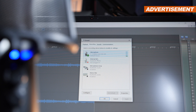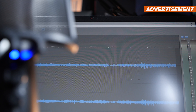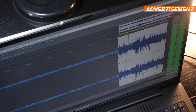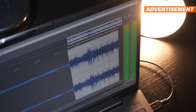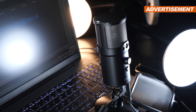The Live Mic M3 is neither a mic with the highest sensitivity nor the lowest. If you're speaking as quietly and softly as I do, the microphone level setting within Windows at 100% will not be sufficient to be heard loud and clear — you'd have to do a bit of post-processing to fix that. Luckily, these days that's easily fixed with just a few clicks. Even if you're live-streaming, tools such as OBS offer you the ability to apply real-time effects to your audio track, including compression. For a normal, more usual speaking volume, the mic offers a really nice sweet spot. Should you end up being too loud, reducing the levels is one of the simplest things to do. Just be ready to live with a tiny bit of static noise in the background if you record quiet performances, except if you apply post-processing or smart effects to cancel that noise out.